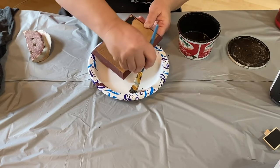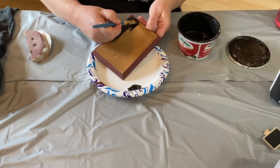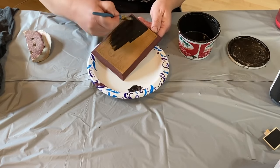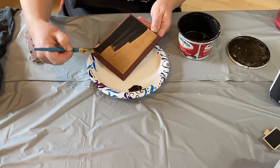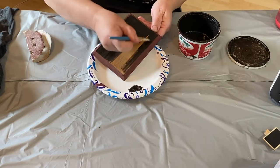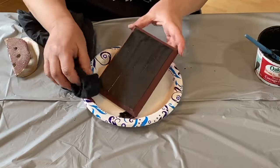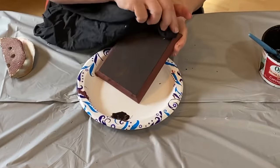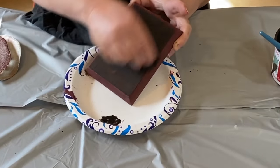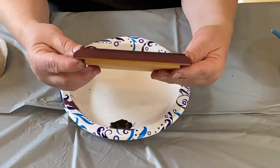Here it is right here and I can't tell you how much I have in that antique wax. You just have to play with it and figure it out yourself. I've added to it so many times I don't know the ratio anymore. So I'm just brushing this on. I know it looks like black paint but it really is wax stained with a little bit of black paint in it — very little. Then I'm just taking my rag and wiping it off. Once that gets wiped off it looks more brown-black and you can actually see the wood underneath. It looks pretty cool.